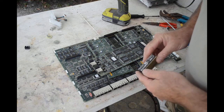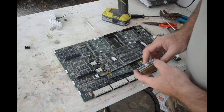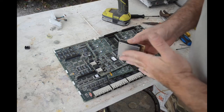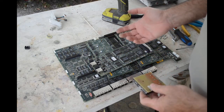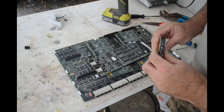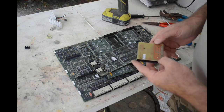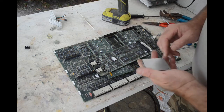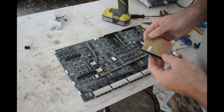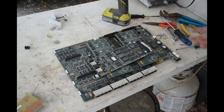This DC-DC converter I may have to keep and play with - it's interesting, a nice little power unit. Wide input voltage range 36 to 75 volts, outputs 5 volts at 30 amps in this little package. No wonder they had it mounted to the aluminum backplate, and no wonder the backplate was aluminum - it's a much better heat sink than steel. It's all starting to make sense now. I'm going to keep this, add it to my collection - it may come in handy someday.